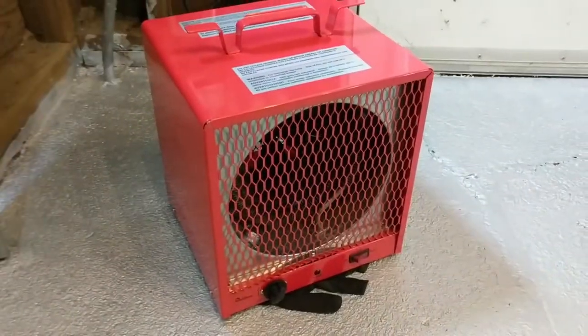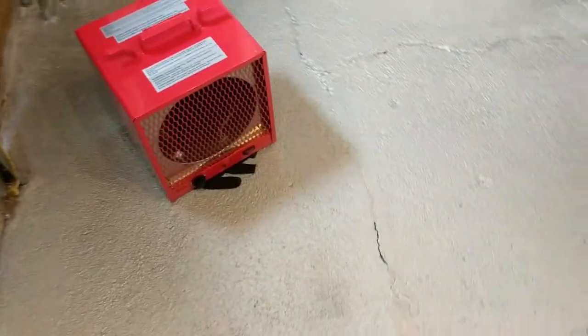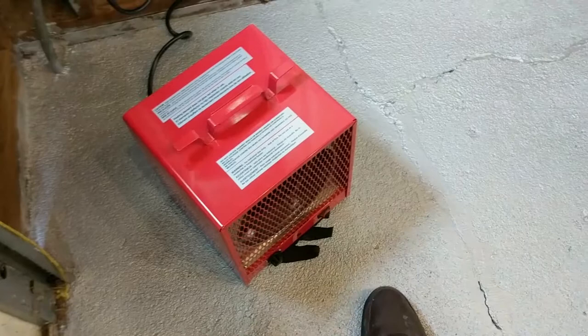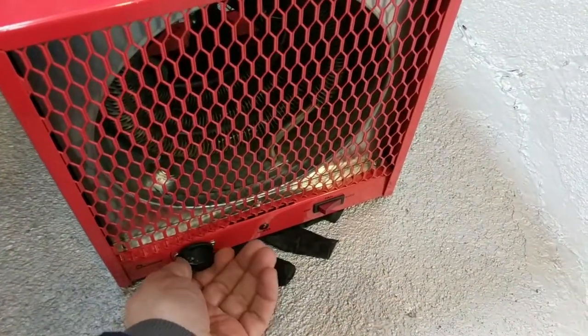So this is, I think they call it a commercial heater or a building heater. It's good for if you're doing construction work, and it's great for this. It provides a steady warm heat, not hot, just warm. It's nice because if you get too hot a heat, for example, the kerosene, they'll throw almost flame out the front, and this area right in front then gets incredibly hot, but an area over here doesn't. This throws out more uniform heat. I'll show you what it sounds like when it's on. It has a thermostat on it.